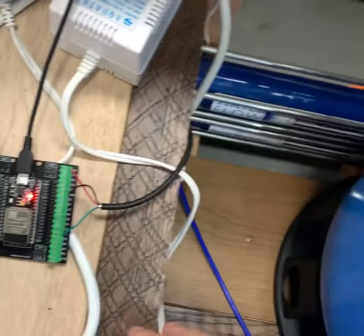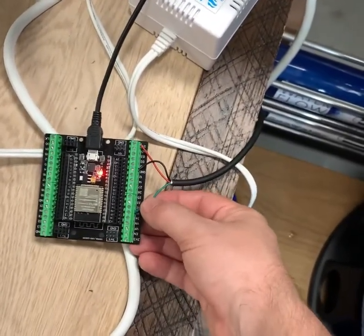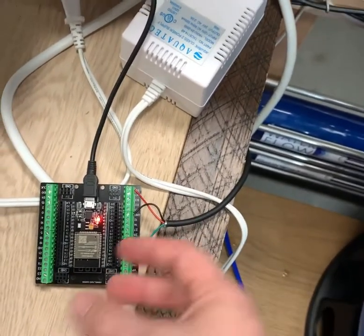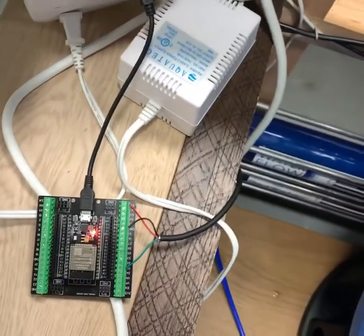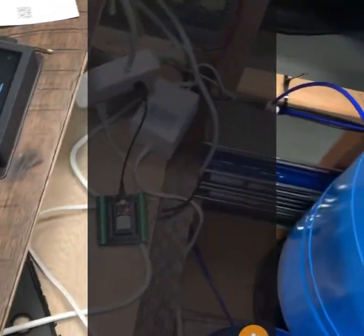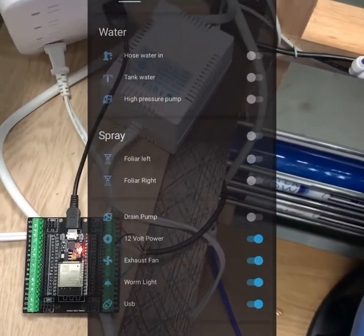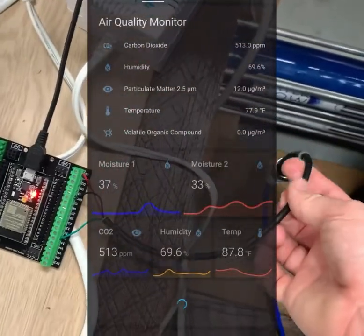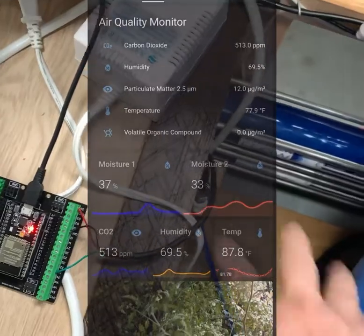That voltage is a linear expression of how much pressure is in the tank. So I need something that can read a voltage between 0.5 and 5 volts, do a calculation, tell me what that is in psi, and put that into Home Assistant — the software I'm using. Home Assistant is really well designed and there are some similar hacks people have done, but as far as I can tell nobody's done this with Home Assistant yet, so I had to invent the code for this.